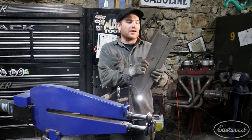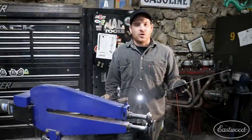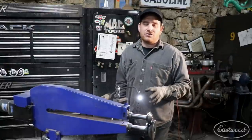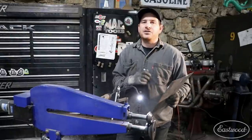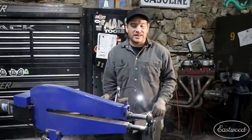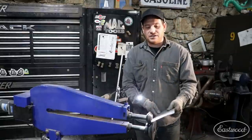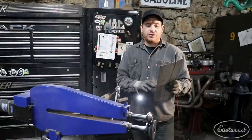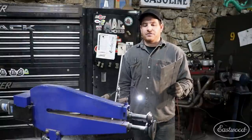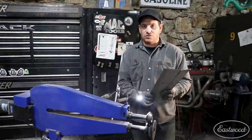I got my piece all cut out, sanded, cleaned off the metal - just using some extra drops I had from building other panels since we're doing something small. What I'm doing is I mounted the hem die set for the motorized bead roller. It's a three-step process. Basically no longer do I have to do the hemmed edge by hand with a homemade tool, hammer, and dolly - you can do it with this hem die set. This is step one of the die set - it has a little guide or lip on it that you basically just run through and it's going to set a preset hemmed edge. It takes a lot of hammer and dolly work out of the process and makes it more smooth and controlled.